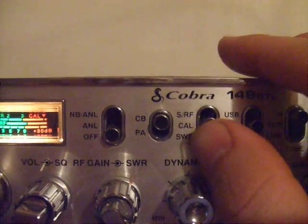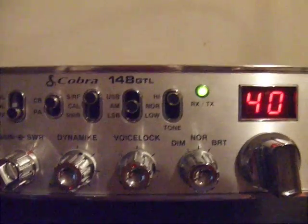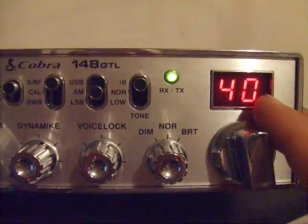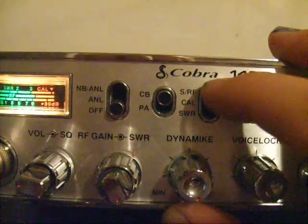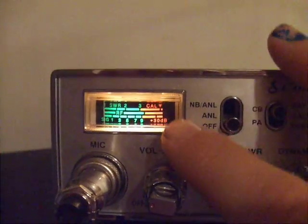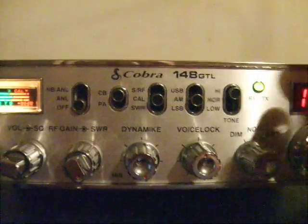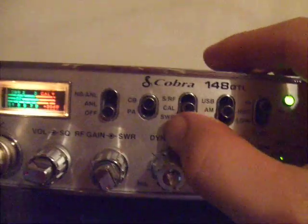That's because the antenna is tuned to the middle of the CB radio frequency band. If you're going to be spending the majority of your time on channel 40 and want optimum performance there, you need a tunable antenna. You tune your antenna in combination with doing standing wave checks until you get the SWR as low as possible on the channel you're going to use most often. I stay on the low numbered channels so I calibrated for channel 10, where most of my family stays.